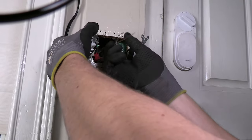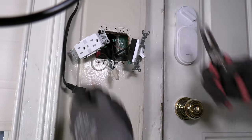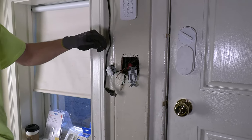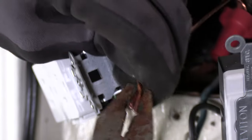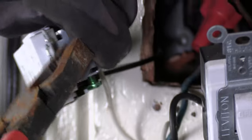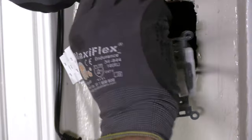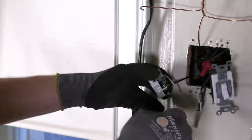That's a little short — it is so far back in there. I thought I cut it plenty long, so I'm going to pivot my concept and pigtail my grounds off of this. That way I'll have one ground going to each device. I've got my two shepherd's hooks here and I'm going to pre-twist those onto my ground conductor. At this point this conductor is my main ground. These things are ugly, ugly, ugly — rusty, a little bit stiff. I'm going to do my pre-twist. Not everybody agrees, but I really am about the pre-twist. Use my appropriately sized wire nut.